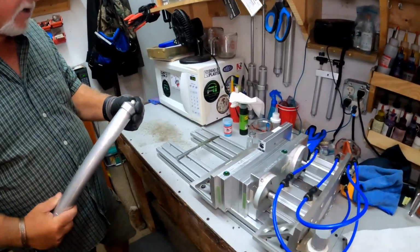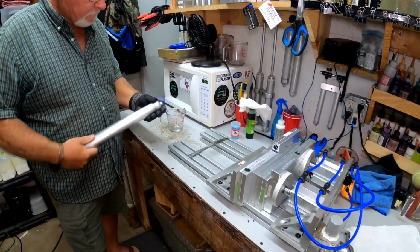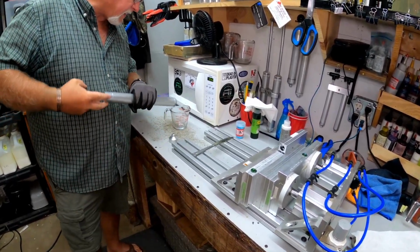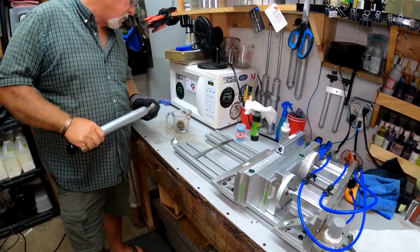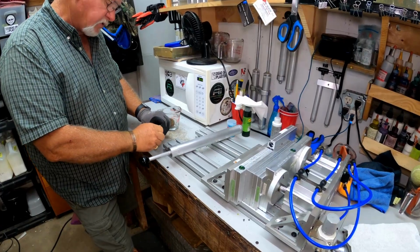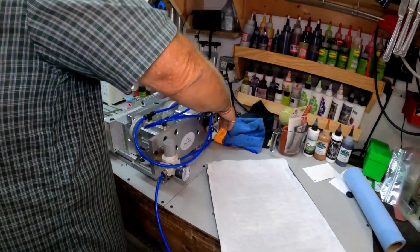Okay, the plastic is kind of cool a little bit. We are going to clear our injector. We're going to pop this out. Because we are shooting a single color, we'll be able to remelt that, put it back in our cup and use it, and it's not going to affect it. As long as we don't burn it, it's going to be good. Now we're going to open our molds and see what our worms look like.